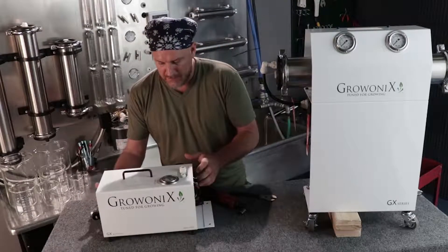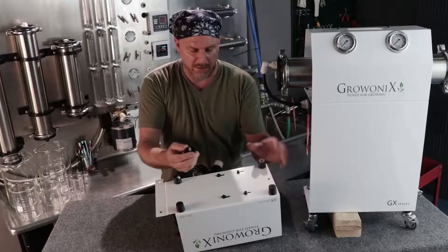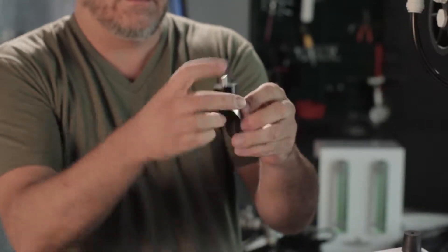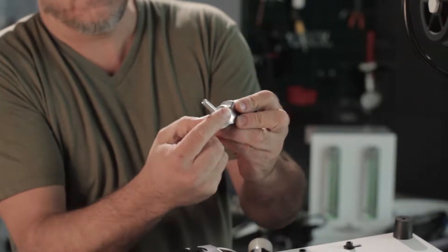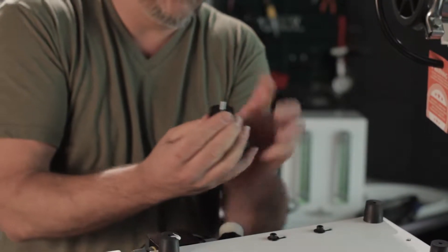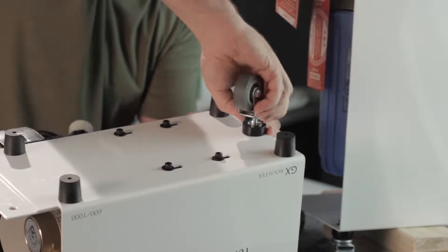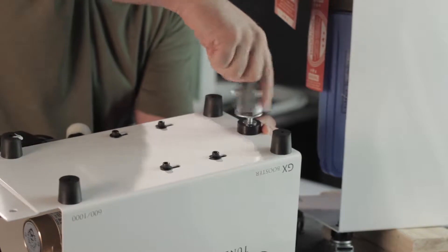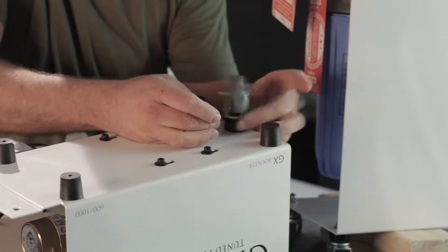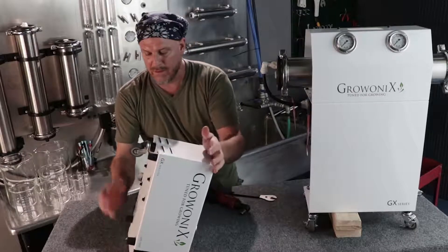The first thing I want to do is flip the pump over carefully and gently, and install this wheel on the bottom. We're going to put the stainless washer that it comes with and the two spacers. On the bottom of the caster is a little washer just above the bearing, and you're going to use that to wind in the wheel. Put everything together, put it in here, and just turn the washer above the bearing. Keep turning it — the bearing's tight sometimes — and just wind it in. Now we're in, and that's it. You've got a wheel on the bottom of the 6010.